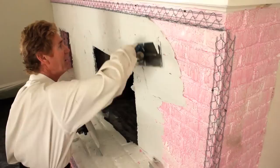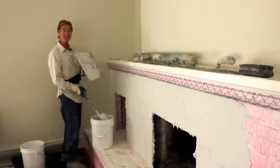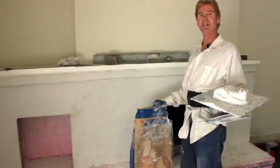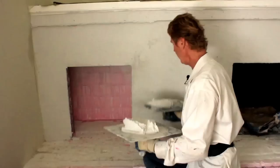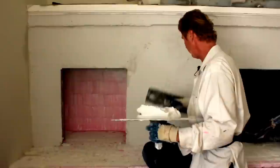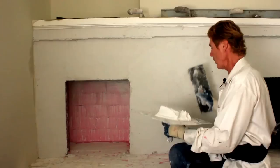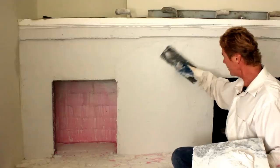We are out of mud — Jay's going to mix me another bucket. When he brings back that bucket, I'll put my second coat on and show you how we rod that. Before I finish up, this is Structolite. Unless you have some practice with it, it is really tough to get right, especially with accelerators. We put a few extra scoops and it set so fast we had to throw a bucket away. If I were you, I'd just discard the accelerators if you're having a hard time with them — and I do this stuff for a living.